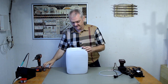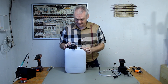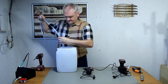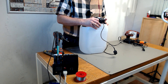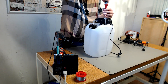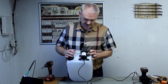The first thing I'm going to do is modify this water tank. I'm going to remove the handle because I don't need it. Now I have space to mount the pump on top — I'm going to mount it like so, and put the hose directly on the pump. For that I'm first going to drill a hole. So we have the hose through here going into the vessel, all the way to the bottom. I'll attach the pump by screwing it in — it will leak some water but I'll apply silicone later, unwind the screws a bit and screw them back in so the silicone gets in between the thread, and then it will be waterproof enough.